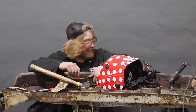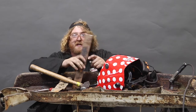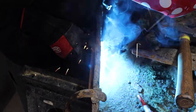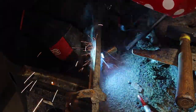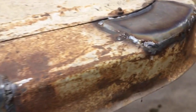It's mighty hot in here today and I'm blowing holes in everything, so we've got to try a little magic trick. I'm going to take one of these copper bus bars — I just grabbed this out of my electricity box. If I hold this on the back of the weld, the weld won't stick to it, so I can just plow over it like I'm filling bondo on a car. Yeah, it'll fill in all my holes. It's not structural but it's a lawnmower. I think we're done here. Honestly, I'm exhausted and filthy and that was a long process. One of the beautiful things about repairing a lawnmower is you're really actually never done — it's just going to perpetually keep blowing holes in itself and you're just going to patch them and scab some more metal over top.